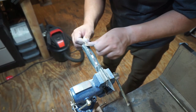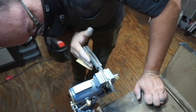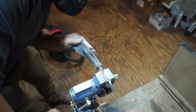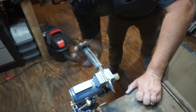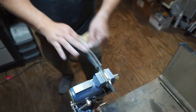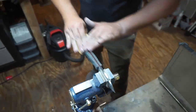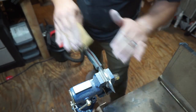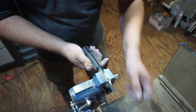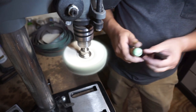You want to make sure you are shifting the whole entire time and not focusing too much on one particular spot. You want it to be nice and round, nice and smooth, with smooth transitions. We went from 320 all the way up to 1000 grit on these, just getting that spine all nice and smooth where all the lines are going one direction — that leads to a really good end result whenever you go to buff it.